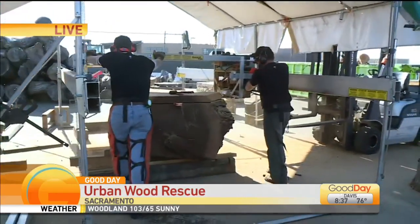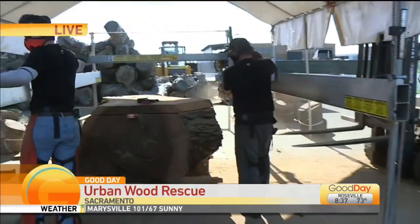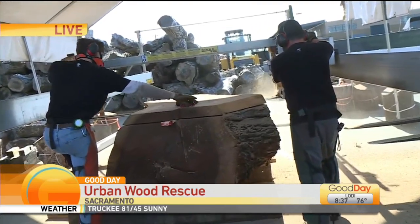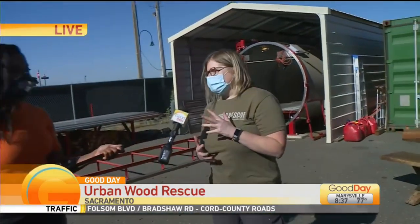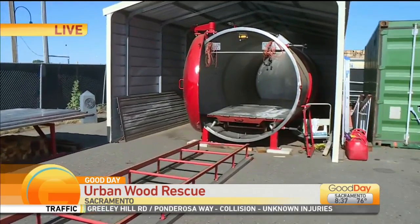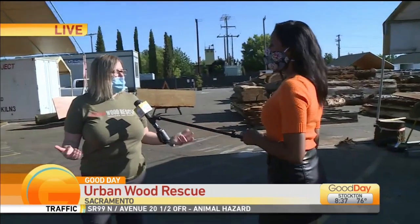It's going to be exciting to see the formation, because every time they cut into a tree, you have no idea what the inside or what the pattern will be. Jennifer with Urban Wood Rescue, after the milling process, what happens next? We will take all of those slabs and stack them. In many cases, they're set aside and air dried for anywhere between six months to two years. And then we put them in a kiln — we have a vacuum kiln here with us right now. The slabs go in and dry from two weeks to a month. That reduces the moisture in the wood so it's available for sale. You want the moisture low because you don't want the wood to move once it's in your house or finished as a product.